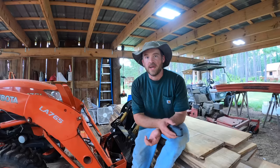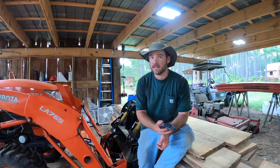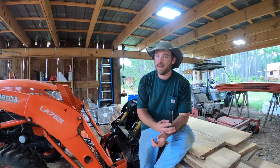So I decided to walk in the house and compare those numbers to some boards that have been stacked and stickered in the living room there for a few months at this point, since January, and I discovered that the moisture was the same. It's 11.23, somewhere along in there on those boards, 11.5 on these. So it looks like I'm not going to have to stack these in the house, I can skip that step altogether, which is fantastic because that would have been a lot.